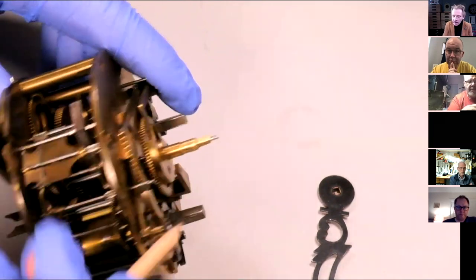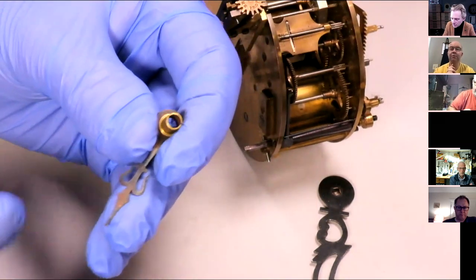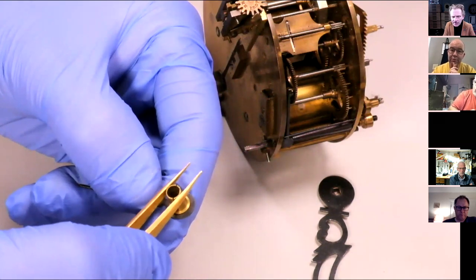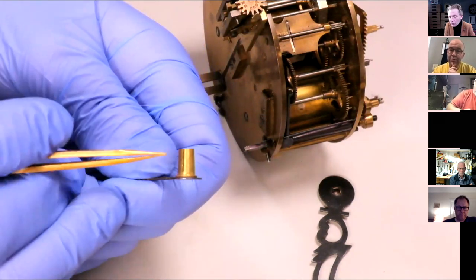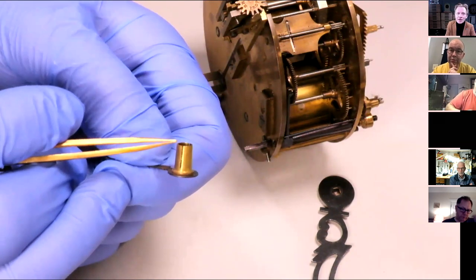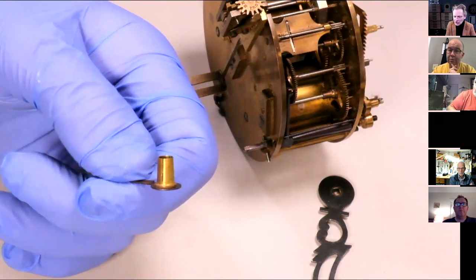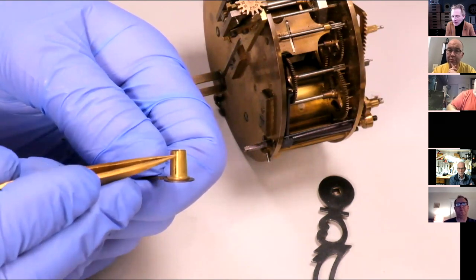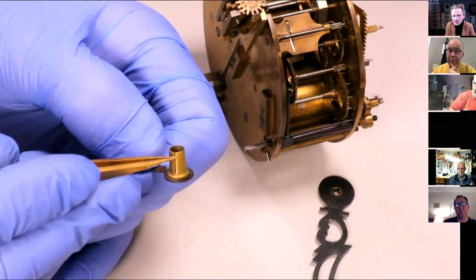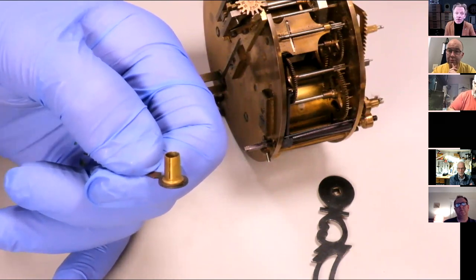So they use that in conjunction with a flexible collet. So the collet is thin enough to be very slightly flexible. And you can see they've sawn along. Now, if I were making this new, you might want to make it such a good fit and so thin that you don't actually need to saw down it like this. Probably better to saw it not like this opposite, but in three. So one slot is never opposite another slot.